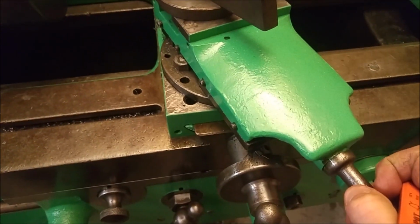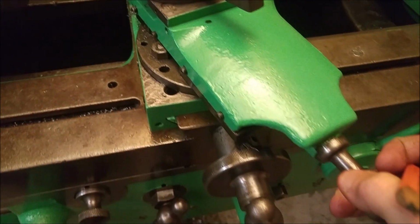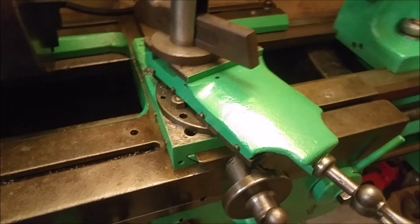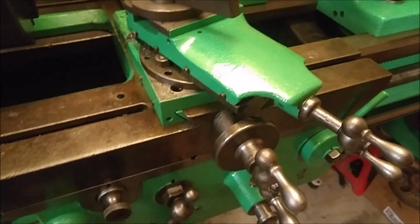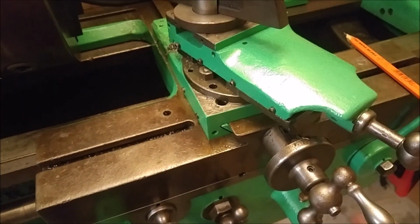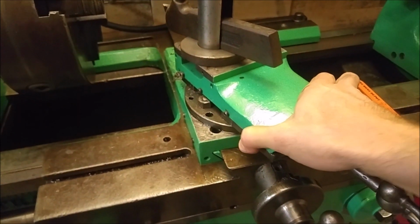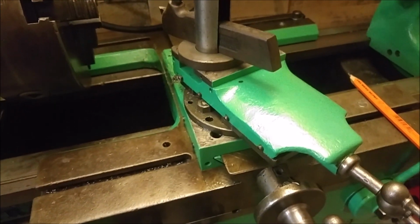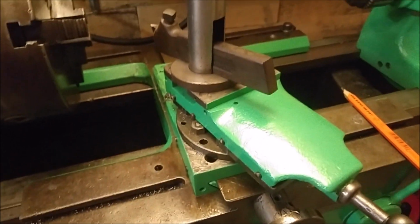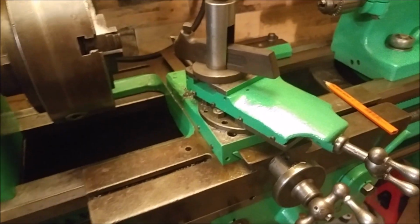It's close to 1/8 of an inch. I should say not end play, but backlash. So it's a little bit excessive. Obviously, once you go in one direction like so, you should be in pretty good shape as far as removing that backlash. Obviously, it doesn't want to move back, but as soon as you go back and back again, you're not going to necessarily get back to the right numbers that you're looking for. So I'd like to do something about that.